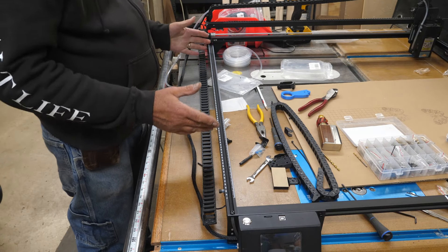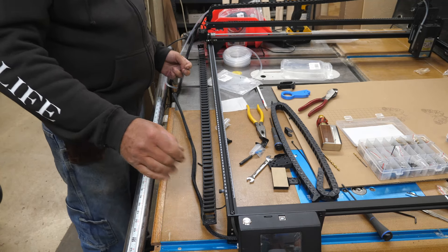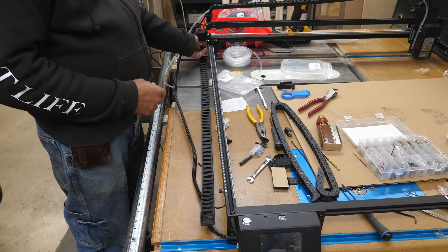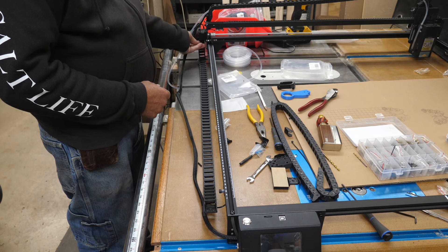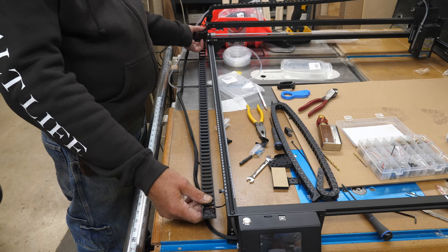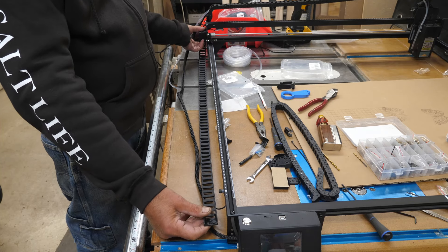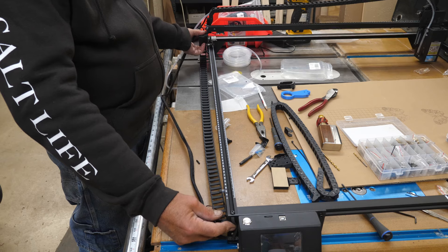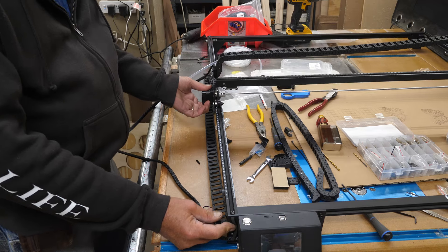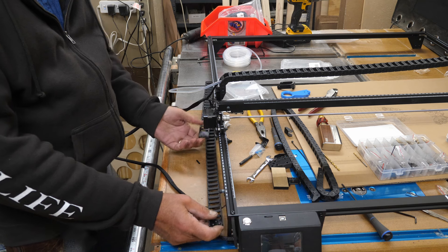On the y-axis I turned the laser around to get it close to me to work on it. The front corners are here and the controller is over there. My theory here is to mount the drag chain to the bottom of this stepper motor. I'll have to extend this chain a little bit — I have some more links — and mount this end down here somehow so that when this comes back the chain will roll along. I think the cable's long enough to do it.